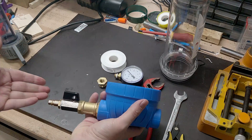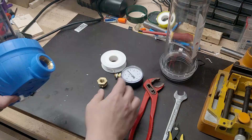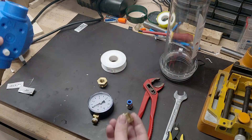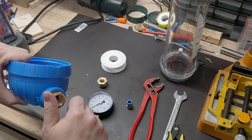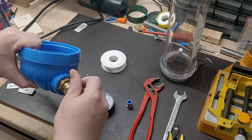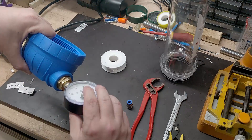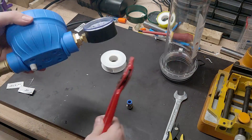This is where the air will go in — I can block it like that. On this side I'll add the pressure gauge, which is in bar, but that's what the home improvement store had. The other port I'll use for my CNC. Again, reducing: three-fourths to a half, then a half, then one-fourth. Then screw in the pressure gauge. As long as it screws in easy I can do it by hand, but when it gets hard I'll use the pliers.